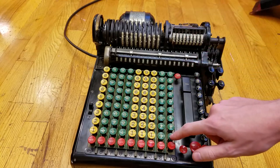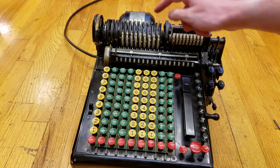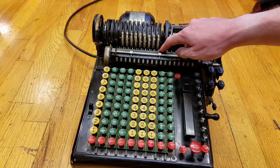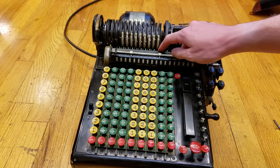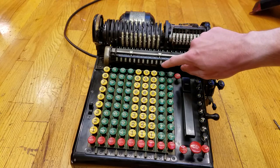When you set it to a number, that determines when this will pop out and activate. For example, if you set it to 1, eight of the pins on this half ring will miss, but then this will elevate and activate the last pin to engage with the intermediate wheel here. If you set it to 9, as this rotates around it will pop out and all nine pins will engage with this intermediate gear. So the varying number of pins engaging as this drum rotates determines what number is entered on the digits here.